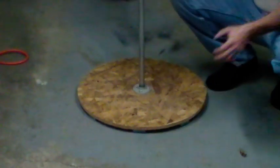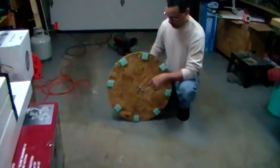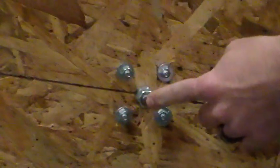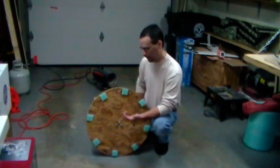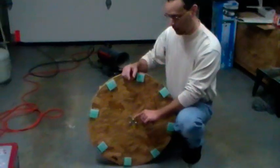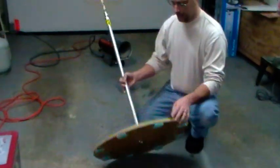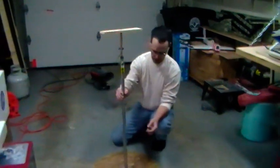The platform is a 24-inch diameter circle. Here on the bottom, this is something Mr. Herbert did on his - he has a bolt that runs from the bottom up to the top. I didn't do that. I just took a piece of all-thread, about four or five inches long, ran it up through the bottom, put two nuts on the bottom - one on the inside - and just cranked them tight, then put the pipe down on top of that.